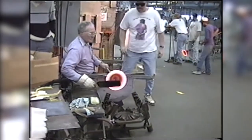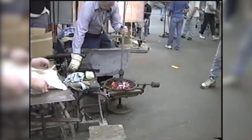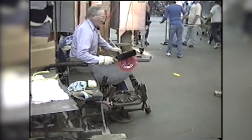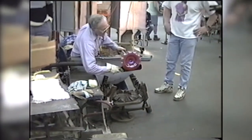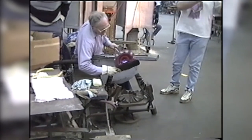And so in this particular shape, when you turn it inside out, the stresses are sort of backwards. And it was very difficult to get these whimsies annealed, and I understand that most of them ended up in two pieces at the end of the lehr. Again, because they're going through more treatments, changing the different shapes.